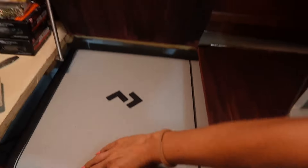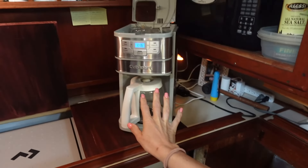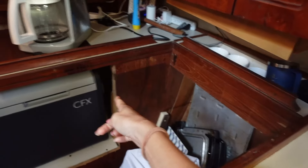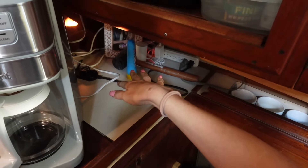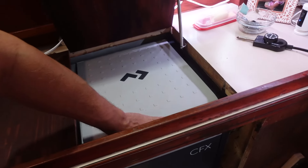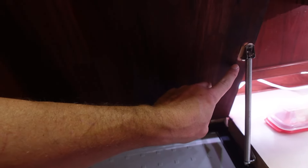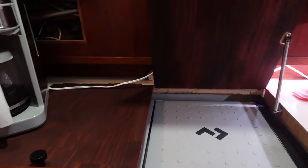Seth got the freezer in last night — let's check it out. Problem number one: it doesn't open there. Problem two: that coffee maker has to stay, I just filled it. But when I lift this up, it hits here, so we have to scoot the whole thing this way. There's a little handle in here, and we're going to put a wall here and create an insert to have storage for extra food. So today we have an issue with our freezer opening and hitting our strut there. I moved the top over already, but I got a router — I'm going to route this out and move that mount in. And then we should be good to go.